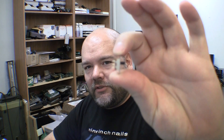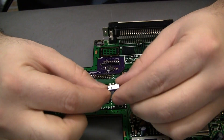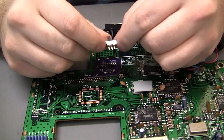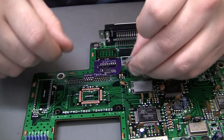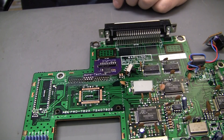So I think: solder on the switch, solder to the pads here. I use a simple single pole double throw — it's got three legs on it. I'll show it down here — I've made the pads so they're just kind of one-for-one: the middle solder pad is the middle leg, and then the outside pads are the outside legs, and it doesn't matter which way is which. I'll do that off camera since I don't really need to show it, but I need to find some wire and get that wired up, and then we'll go test it.